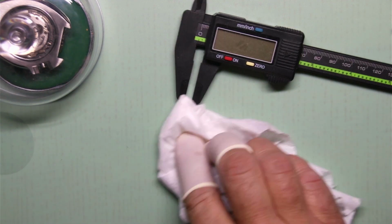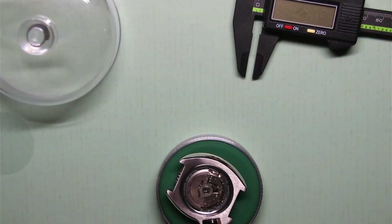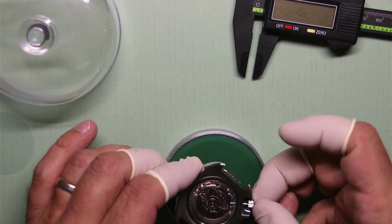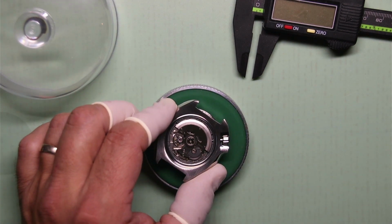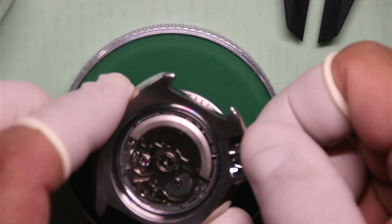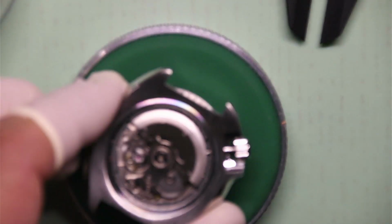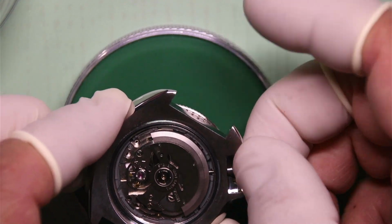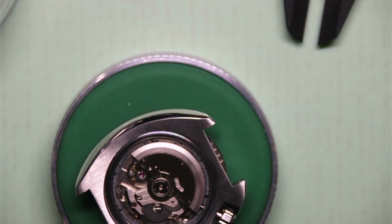So now you want to make sure that you cut the stem short enough so that you can actually screw the crown on all the way so that it seats properly. And here you're going to see me show you. You want it just so that, for the engagement of the threads, you have to push it in ever so slightly. So you measure literally from the end of the tube to the side of the crown that's towards the tube, and then cut that off.